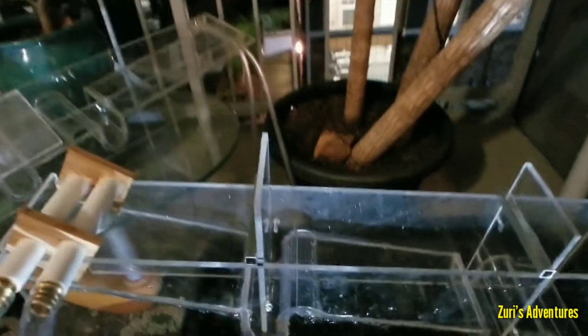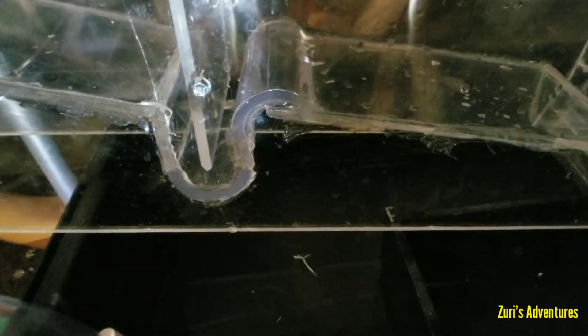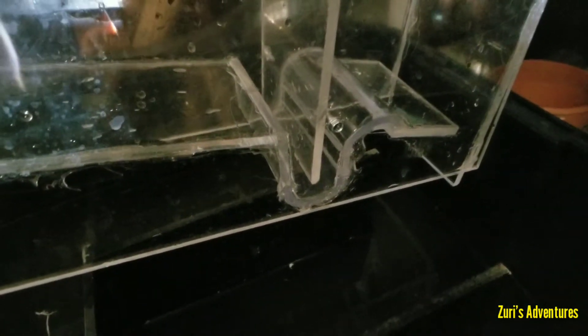Also like on the other one, I added that top little riffle going across after the underflow sluice box, which I think really helped. So I incorporated that into this one as well, and the one at the bottom too. Another big difference is I made the distance between the two underflow sluice boxes a lot farther apart, which also helps the material move along.